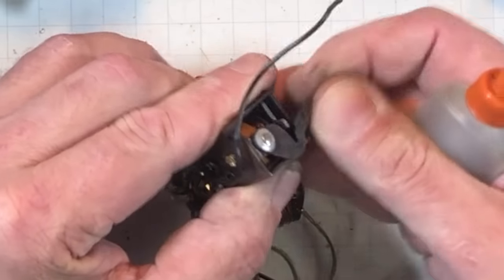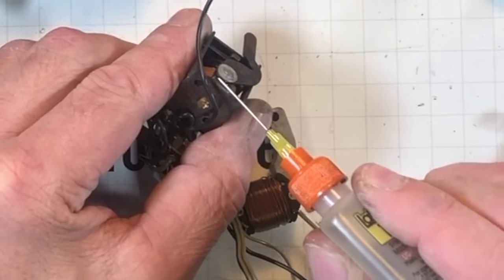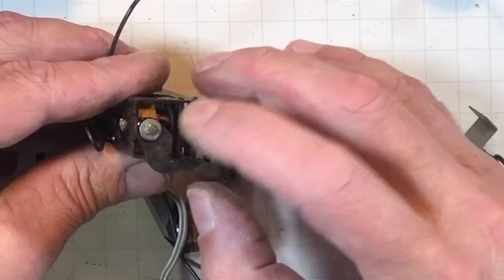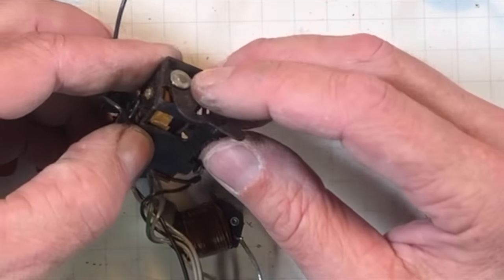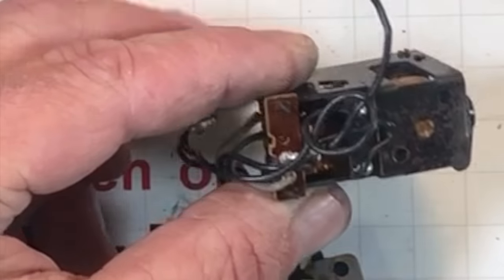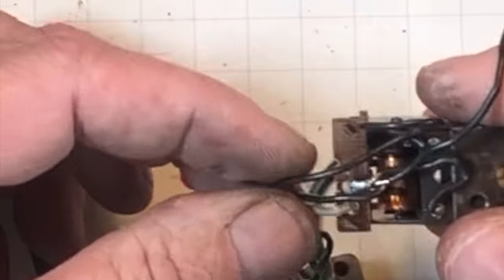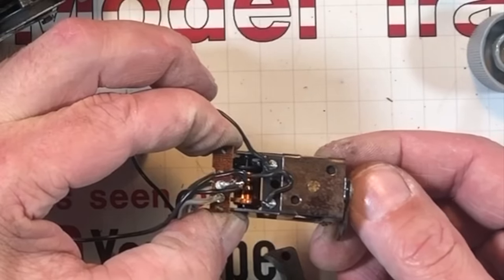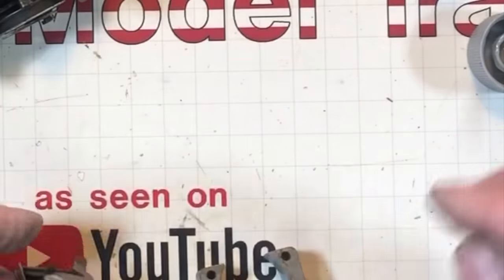Super dry. If you can tell that it's moving, give it a little taste. Here's our lockout lever, and it's really quite stiff. This would be locked out, keeps the reversing solenoid from moving, and this would be what it's supposed to do. And in here, you can see this drum down inside there we're trying to cast our peepers on. A lot of wires in the way. You can see how it's turning in there, changing our continuities.